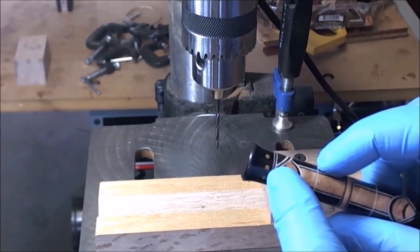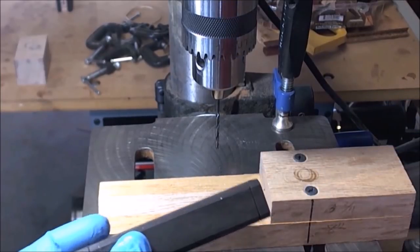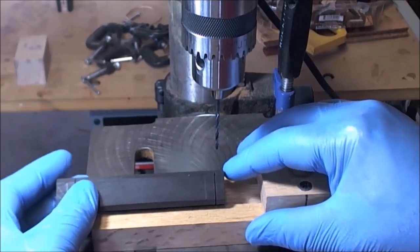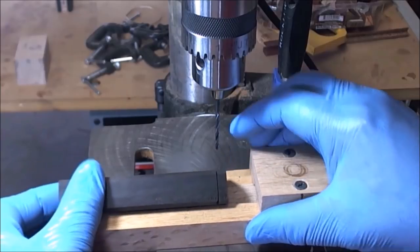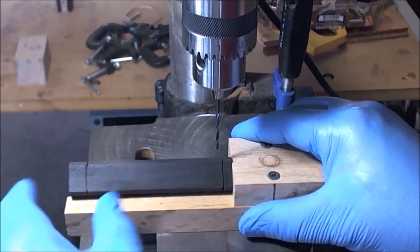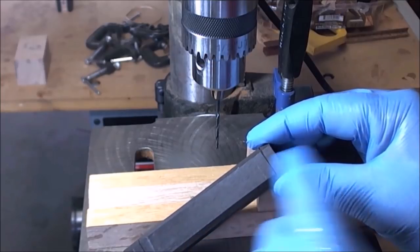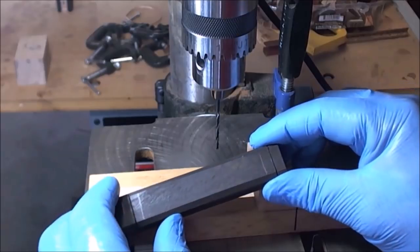These are crooked, not lined up very straight on this Churchill rollerball. These little pegs on the bottom, on the foot or the finial, whatever you want to call it, I tried to eyeball. With these lines, I just used a handsaw and a stop block to inscribe them. So I'm just going to line that up, drill that down, and then cut off a small section about a half inch off. I'll drill a hole for a tenon before I do that.